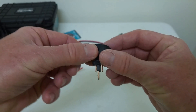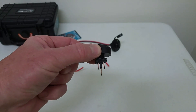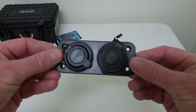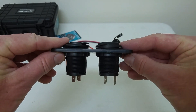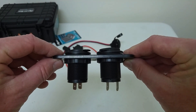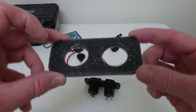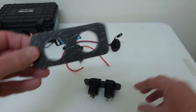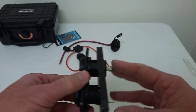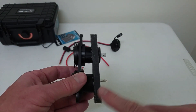Here's what the switch looks like. It's important because you have one tab which is the positive, one tab which is the negative, and the center tab goes to your load or your unit. Then this is the little panel that has the two power ports in it. When I was first installing it into the box, these were a little too long and went too deep inside the box and wouldn't let the battery sit in there. So what I needed to do was make this spacer out of regular cutting board. These slide in here and give you enough space on the outside when you mount it, in order to shorten these ends and make these power ports fit inside the box.